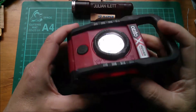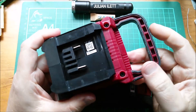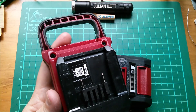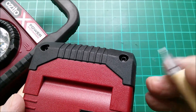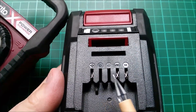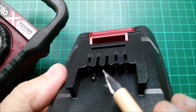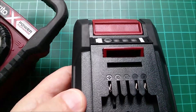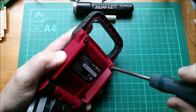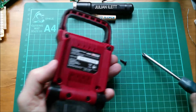This is a very basic three-LED light. Let's take it off the battery and see what screws we've got - just regular Phillips or Pozi drive screws. The battery itself has Torx screws but without the pip in the middle, so they're not tamper-proof Torx. The battery connector has plus, minus, NTC (negative temperature coefficient), not connected, and an ID pin.